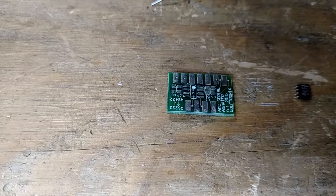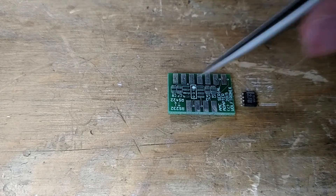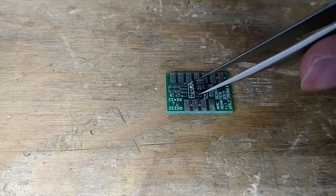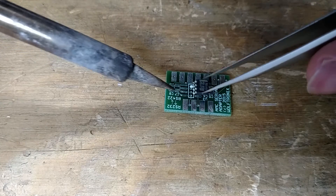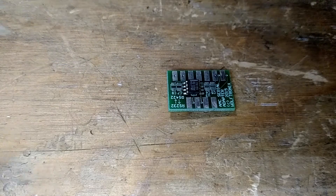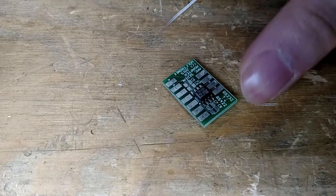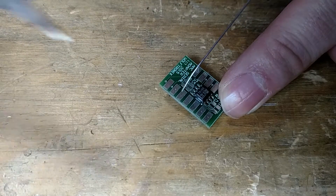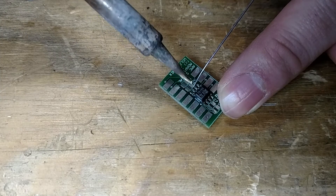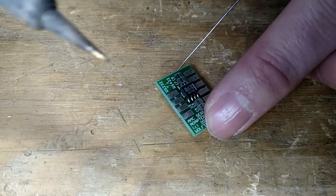This one's got a line over here to tell you which side is pin 1, and the little pin 1 dot is right there. So we want to line that up — this is going to be more difficult because we're off center. But I make it look like I'm a professional and not a hobbyist. We'll go ahead and tack up and actually solder these guys, then flip that around and get the other side.